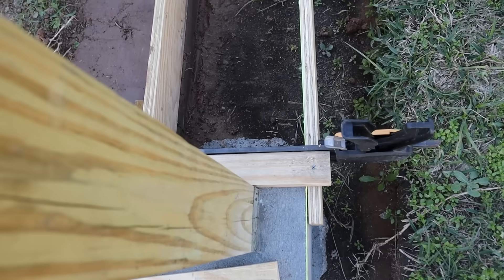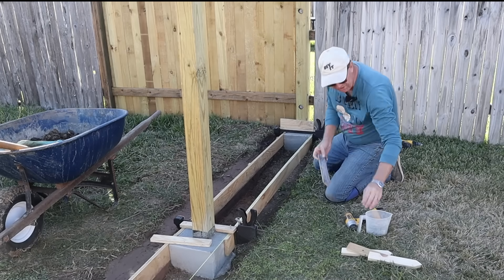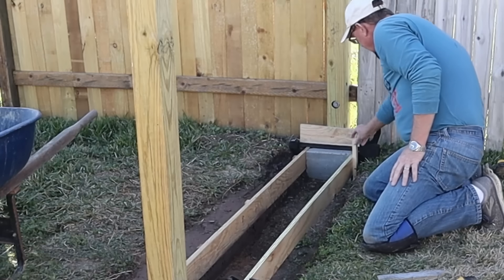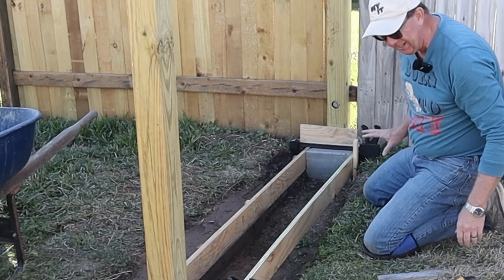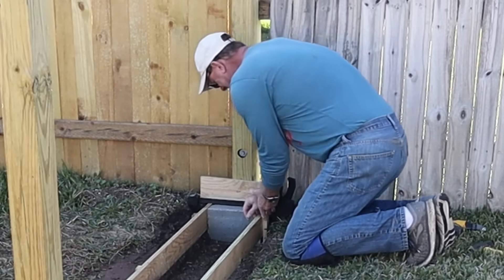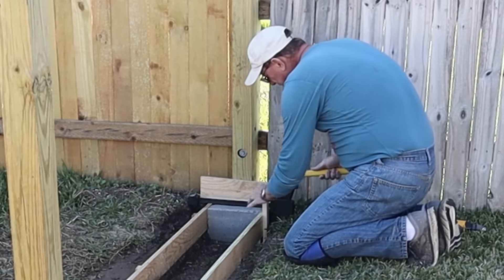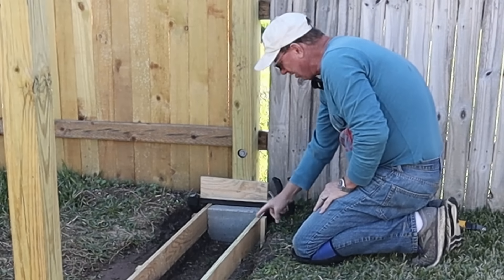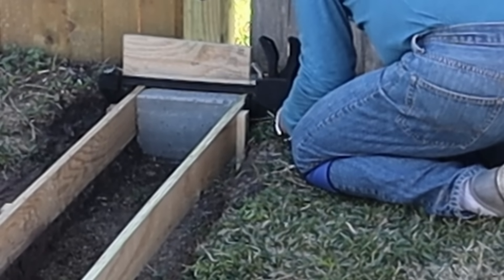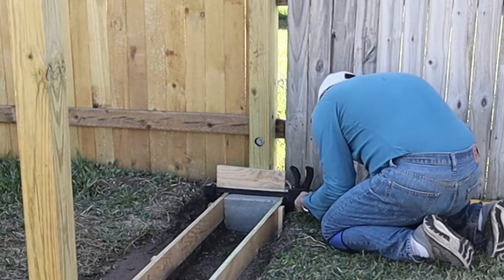Where the string line comes in is if the board is bowed in or bowed out — I can adjust that. I'm going to have a stake at each end and then two through the center. I put my one at the end first because it's completely set and isn't going to move. I do my best to drive these straight down and in, pushing them as far as they'll go. I want the stake below the level of my plywood. I pre-drill because if I don't, the screws will split the wood — again using inch-and-five-eighths screws. They'll probably stick through a little bit, but that's okay.